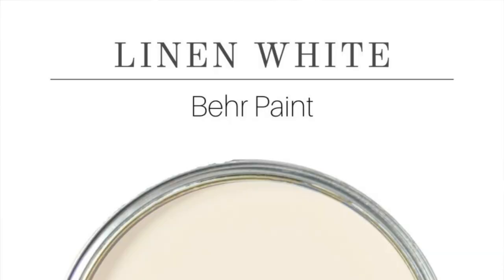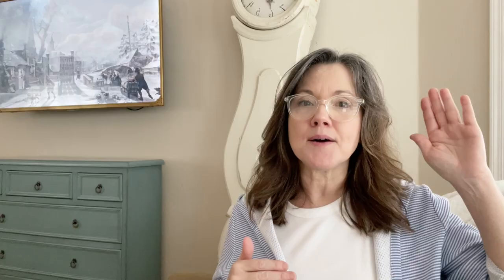We are going to get to the beige-beige colors here soon. The next one is Linen White and Linen White has a light reflective value of 85 — it's not above 90, so it's in the calmer, bright range. It has a more white look to it. Its red is 247, green is 237, and blue is 216, so it's definitely warmer with a nice pleasant undertone. Check out Linen White for your walls, cabinetry, and furniture. You can put it on your ceiling if you want a little bit of color there, and it looks beautiful with a pop of white crown molding.